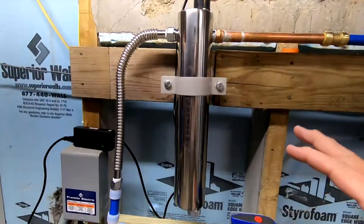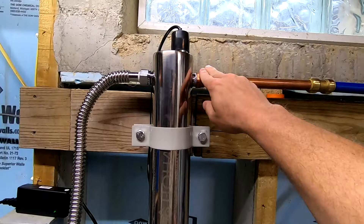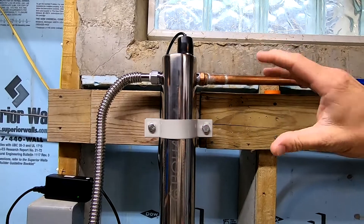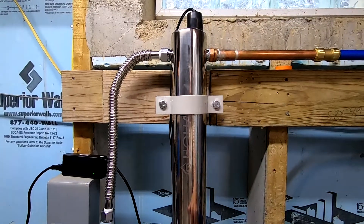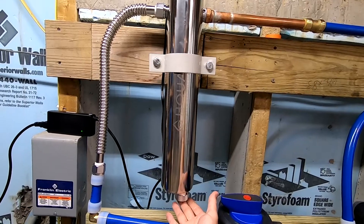When I put this system together, it was actually very easy. I had three-quarter standard pipe thread fittings on both sides. There's a quartz sleeve — they give you a couple of extras and an extra bulb. When you're putting the system together, you basically slide that quartz tube down through the stainless thing. There's a couple of gaskets.